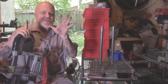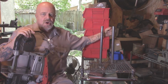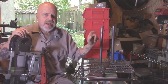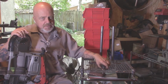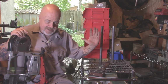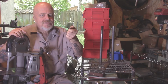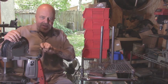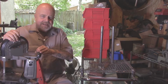We're going to need basically 6 pieces of steel to build the stand. 2 16-inch long, 1-inch diameter pieces of round tubing. You've got a 14-inch long, 1.5 by 1/8-inch piece of flat bar. We came off of it with an 11-inch, 1.5-inch piece, 1/8-inch thick flat bar here, and I welded a little stop onto it to help keep the saw oriented properly here, and a 7.5-inch long piece of 3/8-inch diameter steel bar, which I bent here, that kind of locks through the hole in the handle to keep everything locked in place.